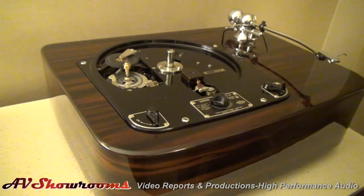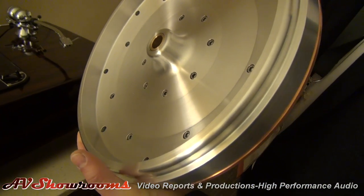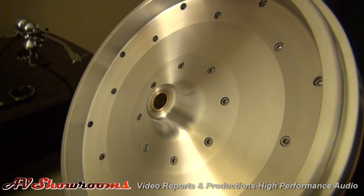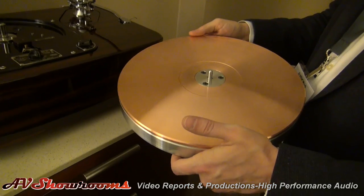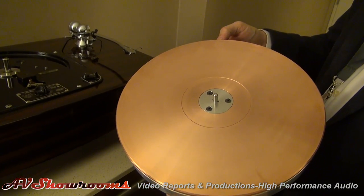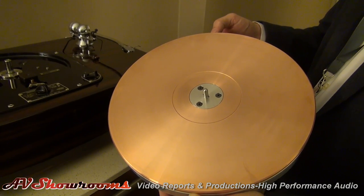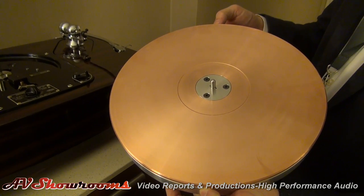You can re-insert — that's the old one before we did it. Look at how that's done. And then you have a choice of whatever you want on top. We have four different material selections for the uppermost portion of the platters: a high-grade copper alloy, a non-magnetic stainless steel, a 7000 series aircraft aluminum, and a magnesium alloy — to suit the listener's taste, as each individual system is slightly different.